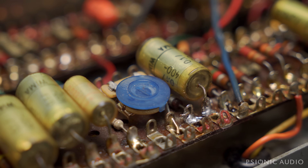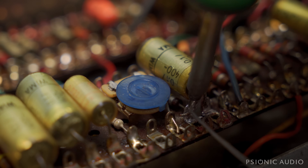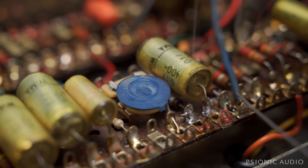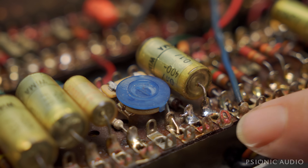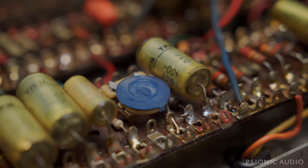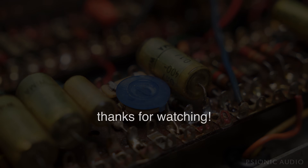Being careful not to mangle the tag, I'll try reflowing that. One non-existent solder joint fixed, one solder joint where the lead of the cap had actually broken the joint — fixed. Just a few jillion left to go through. What was I saying about alcohol being the solution? What was the problem?